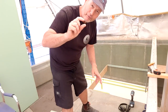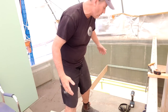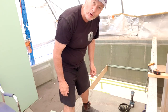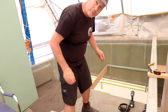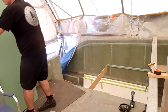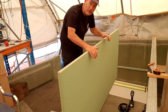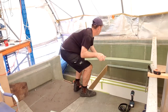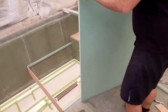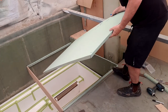The bed bases are going to be 30 mil foam with one layer of 300 and two layers of 600, because they need to be quite solid — it's almost a two-meter span, 1.9 meters long and 1.38 meters wide. There will be some reinforcement underneath. I'll use the 30 mil foam I have left over from the original hull build. You can see it's quite thick and it'll be the perfect thickness for such an expanse. I've now cut this board and it should fit perfectly.